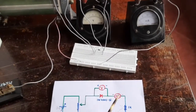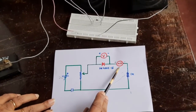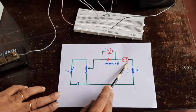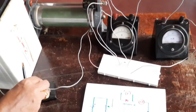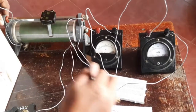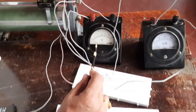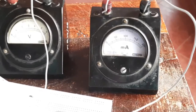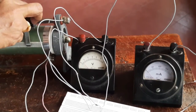Now we introduce the key in the circuit and vary the position of the rheostat, observing the voltmeter and ammeter readings at each position to take V-I readings. Introducing the key and increasing the rheostat from one end, the voltage on the voltmeter is now 0.3 volt. The ammeter reading is zero. I increase to 0.4 volt — again the ammeter reads zero.